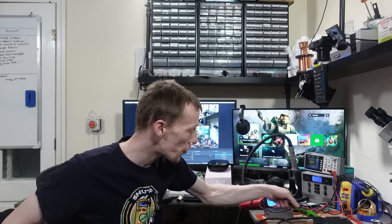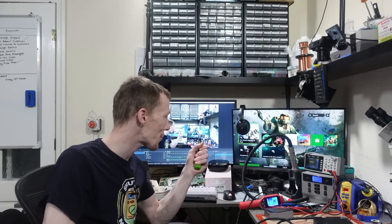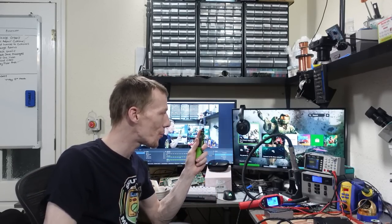A blown MOSFET caused some carbonisation on this one. The grinding pen I used is a cheap Amazon one — I actually bought it to modify Nintendo Switch ports to fit Nintendo Switch Lites, but it's perfect for grinding away at a board. This thing has just made me some money. I am super super happy. This appears to work fine — it needs a full test, I need to make sure it stays on and performs as it should. But it is working, and that's a win.